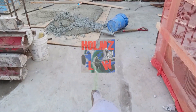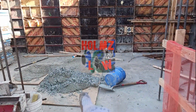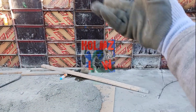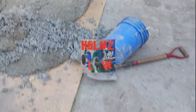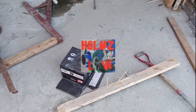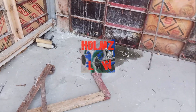So that's basically, in a nutshell, how access lines work. This is the whole access line — it goes through the whole room or area. Behind these boards is the cement wall where my sleeves are. The green line is 150 on my blueprints, and it'll tell me exactly where I have to go. The surveyors will come out and snap these lines for you.